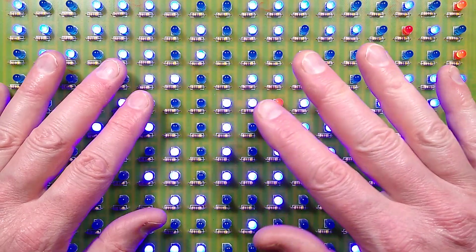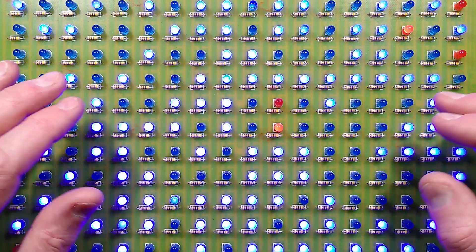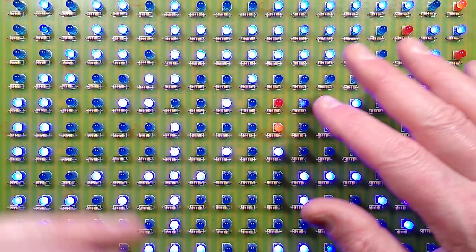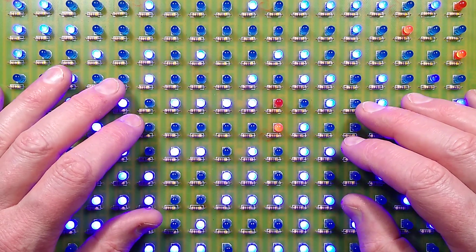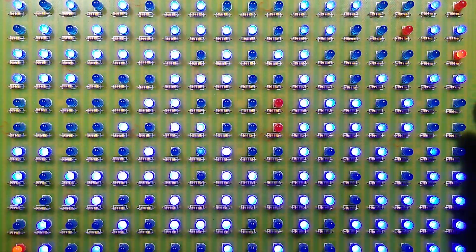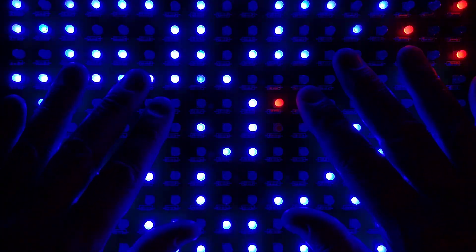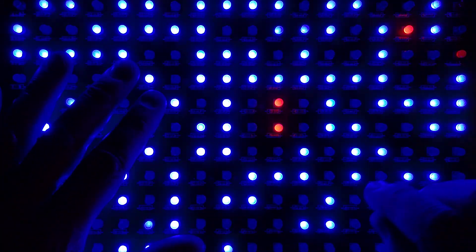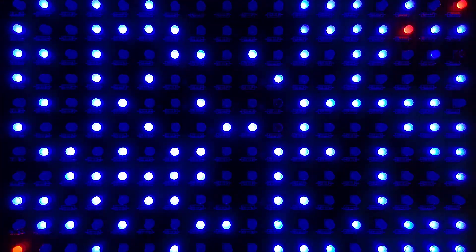This panel has a few red LEDs because I've just repaired it by putting red LEDs in place of the duff blue ones. Quite a few of these LEDs failed — they're standard flash LEDs on a 5V supply with a resistor, but they happened to be dumpster-deal LEDs from eBay. So I've recorded the whole repair process and you're about to see that. I'll turn the light off so you can see just how pleasing this panel looks. The red LEDs are there because viewers of the live stream suggested changing failed LEDs to a different colour so we can track how many fail over the whole panel.